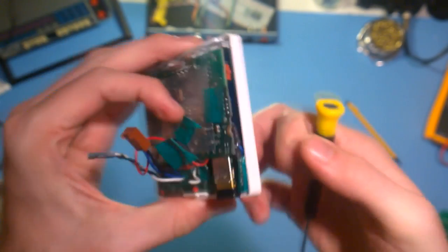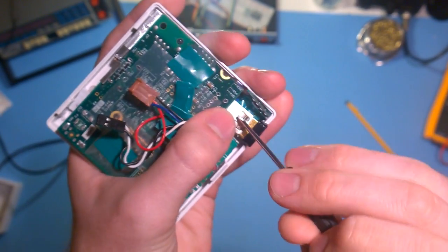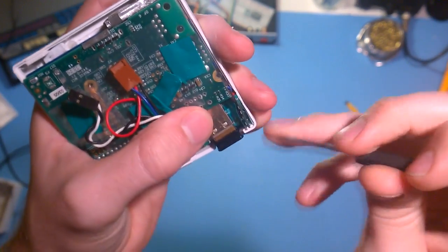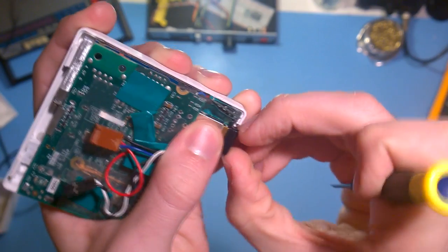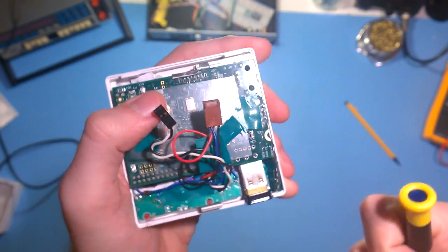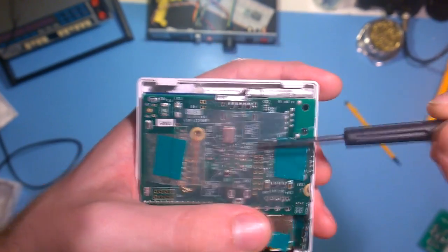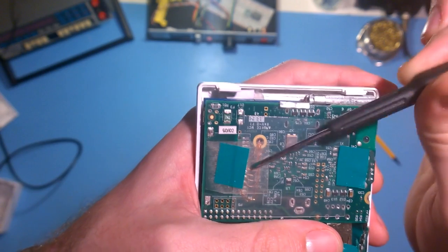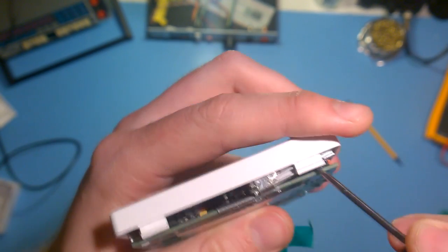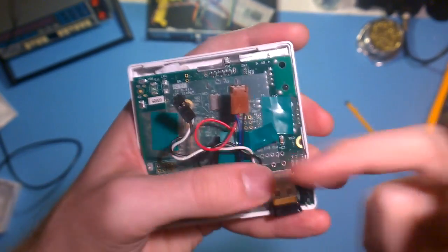This is the main guts of it really. There's a full USB socket — I wanted the full socket there. I could have made it smaller and just soldered the WiFi directly on, but I wanted a socket so that if needed I could remove the WiFi and put in a hub while it was still on the wall to get a keyboard and so on. At the moment without WiFi I'm just using SSH to configure it. The SD card is on the other side with enamelled wire for all the data and power. This is a little heat sink I had designed for it — really basic but it seems to do the job. Tests showed about two degrees of a saving with it on, so I'll keep it.